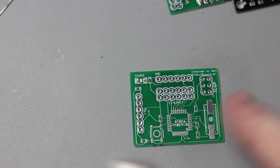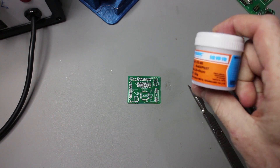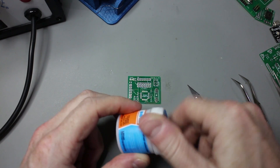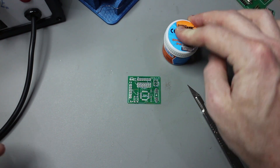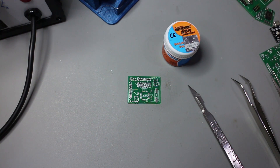I'm going to run through the other method I'm working with now. The setup is a little bit bigger, but it's definitely worth it. This method requires a slightly different toolset - you need some solder paste, which is fairly cheap to obtain. It's just solder in paste form; you can pick it up on eBay and other places. It can go bad if not kept in the right conditions, but when you get it right it's lovely stuff to work with. I keep this in the fridge to try to extend its lifespan.